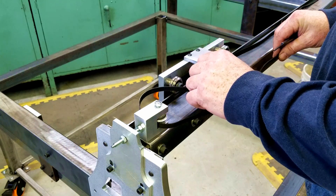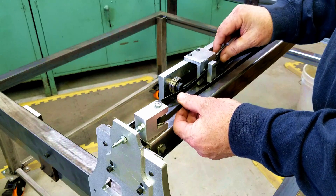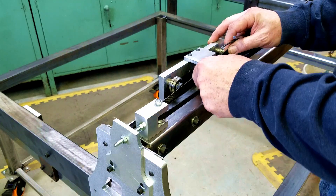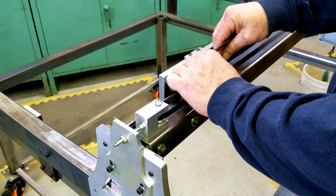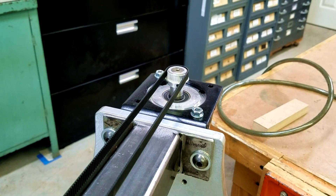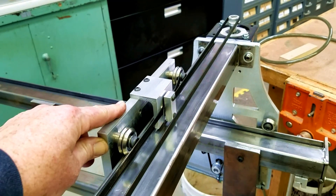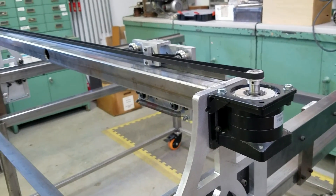And with that part completed, the only thing left to do is string the belt and put some tension on. You can see where that last part bolts onto the end of the y-axis plate right here, and how the threaded rod goes through it to the block holding the idler pulley. That little belt is amazingly stout — once I had it all clamped down and tensioned up, I was able to push the carriage by hand and it would rotate that 10 to 1 planetary gear unit. Alright, so we've got all the belts on. The y-axis was done the previous episode, x-axis is done now, which means the next video will be installing cable track, motors, doing a little wiring, and doing the first test runs.